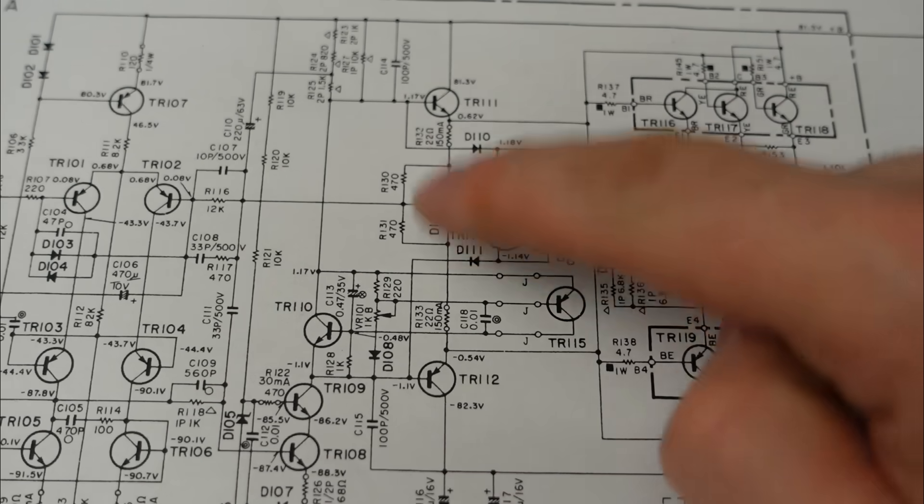You don't need to be an electrical engineer or genius to read schematics — they're actually quite simple, just like road maps. And before car GPS, everyone could read a road map. Once you're equipped with a block diagram and a map of the circuit boards, you're in a good place to start identifying where the fault might lie. If it's dead, start with the power supplies. If there's no output signal, follow the input signal all the way through until it stops. Then zoom into that part of the circuit, looking at specific components — maybe something's short, maybe something's blown open. The fault will be right in front of you. This process ensures you're heading in the right direction.